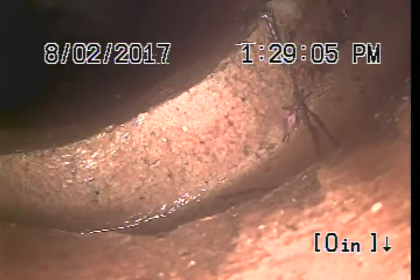We did run a huge, large laundry basin full of water, and it dumped fantastically. Made it here, and then eventually out to the city sewer. We went out and located this, and it's right at the curb. There's a downward slope to this section of pipe. It's got a little bit more grade than the normal 1/4 inch drop per linear foot, that's why you don't see any water pooling here or anything like that, because it's a bit steeper.